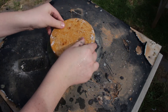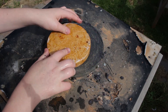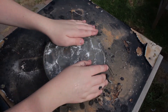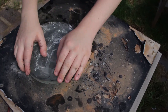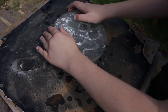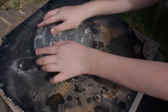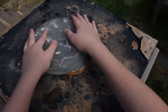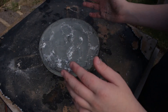To start removing glass I'm basically just rubbing the tool and mirror together under about five to ten kilos of force. The mirror is placed on top of the tool with the edge of the tool on the centre of the mirror to dig out the centre as fast as possible. The mirror is moved back and forth. To make sure deepening is even you need to continuously walk around the tool. The mirror is also spun about one eighth regularly in your hands, and the tool should also be spun every thirty seconds or so by a small amount.